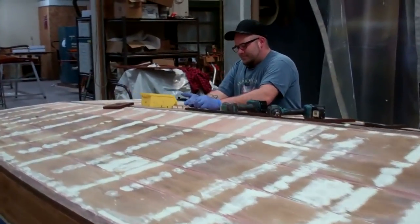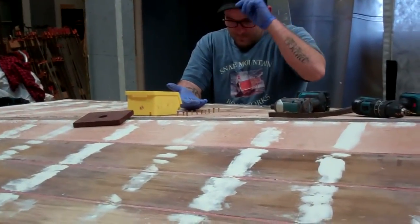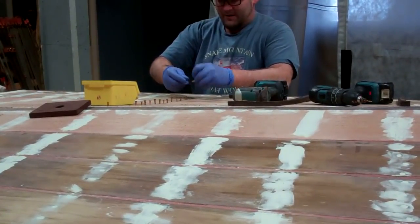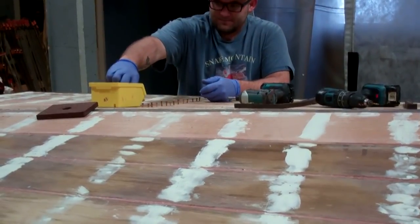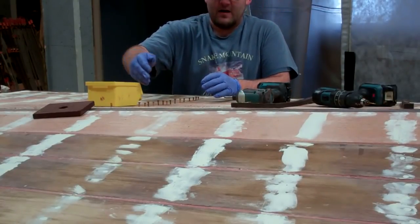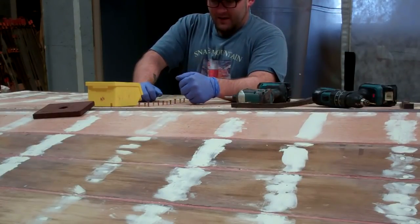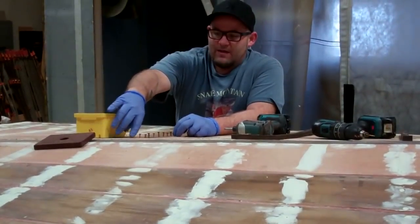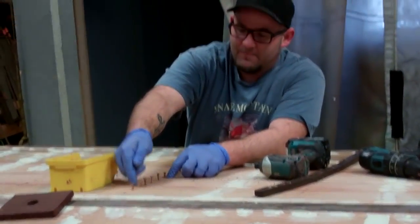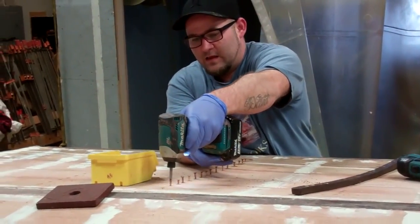We see that Joe has begun the work on the top side. These are the preliminary screws — this is not buttered, this is preliminary. Joe, why do you stand all the screws in the holes first? So the reason is it makes it a lot easier; once they're already in, you can go down through the batten a lot quicker. But as soon as you start after the batten's been lathered with 5200, if you don't have these screws all in the holes, as soon as you start tightening one down, it's going to start shooting 5200 up from each of the other holes — which you don't want. So a whole series of little volcanoes. Correct. Let's not have volcanoes.